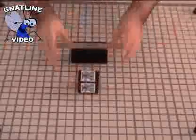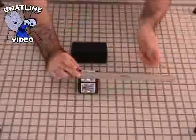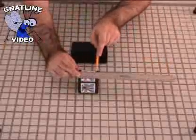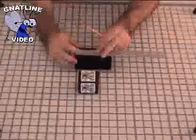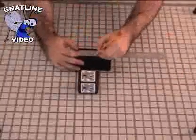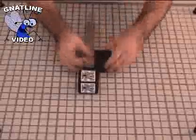The optimal size that I found out is about 2.5 inches. So we're going to measure 2.25 inches for the bottom part, because we're actually going to end up taking a portion of that project box out. We're shrinking it. So again, transfer your measurements of 2.25 all the way around the project box. You could just put it on one side if you feel lucky, but I prefer to go all the way around just so I know I'm getting a nice clean cut.